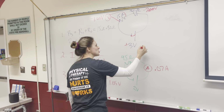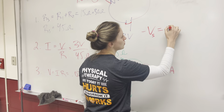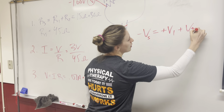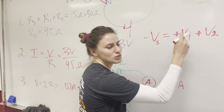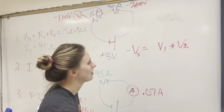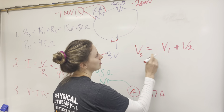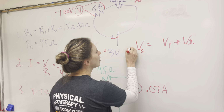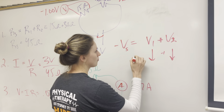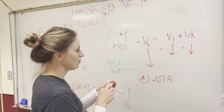Okay, what was that equation you had the other day? It was like the equivalent voltage equals V1 plus V2. And the plus sign, don't take the plus sign in front of the V1. I couldn't remember what you had. Here's the deal. V1 and V2 are drops, so they're going to be negative. You had it right. So the battery is positive, and in order to make it an equation, you've got to put a negative in front of them. Oh, yeah, I see. So like that.